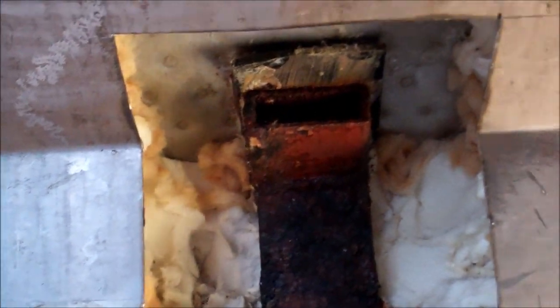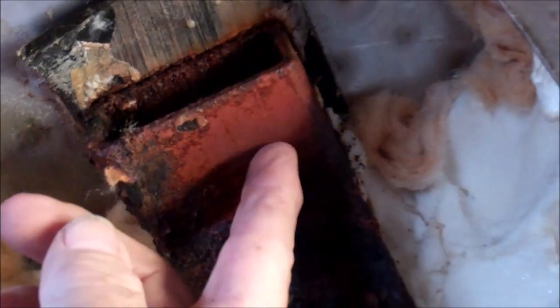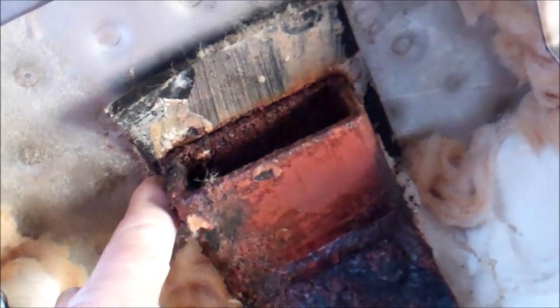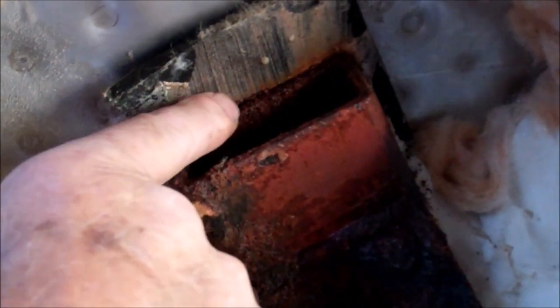There's a hole cut through the side of the tank near the front leg, and the leak is hidden by the frame. I'm going to have to cut this frame off because there's not much length here and I'm going to have to rebuild it. We need to cut about at least 25mm off. The leak is under this corner, about 15mm below the end of the frame.